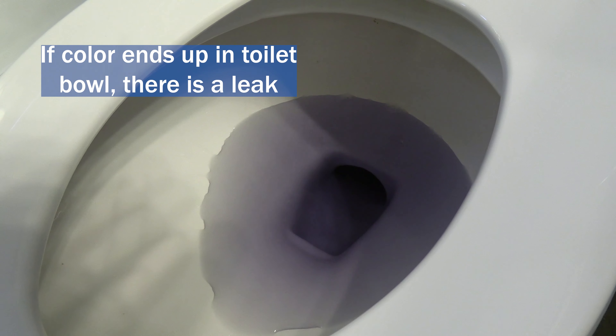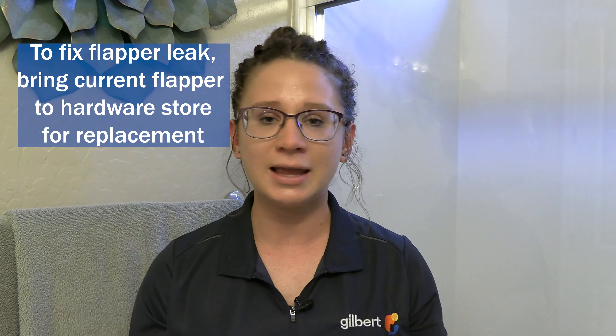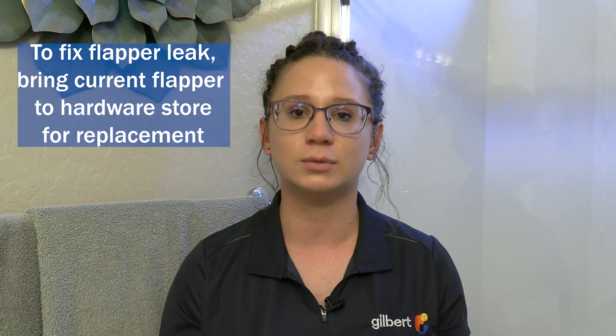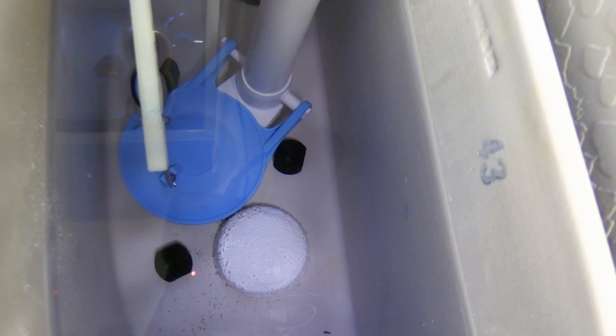You can see that there is a leak in the toilet. If you do have a flapper leak, we recommend taking out that flapper and taking it to any hardware store. It's very important to try and get the same toilet flapper that was in there previously. There are universal flappers, but definitely try to get the same flapper that belongs to the model of the toilet.